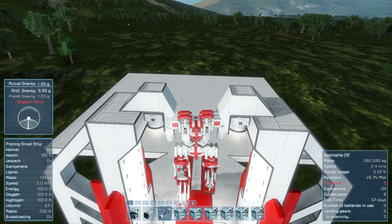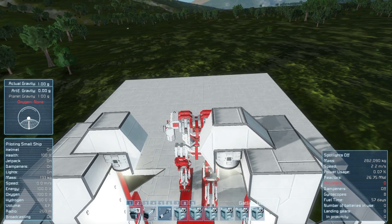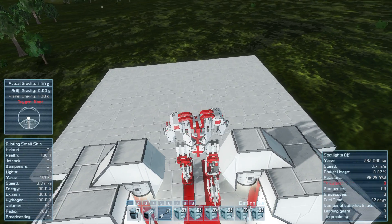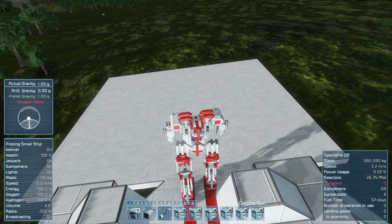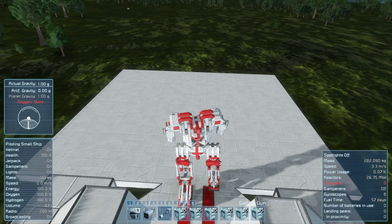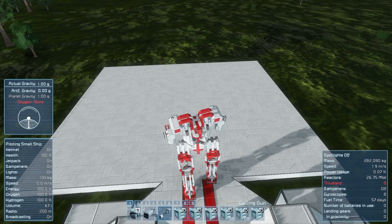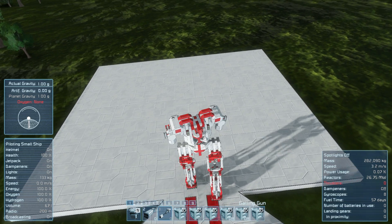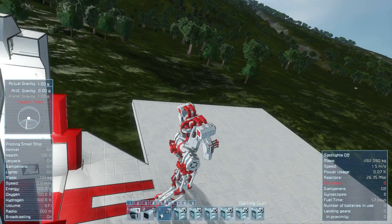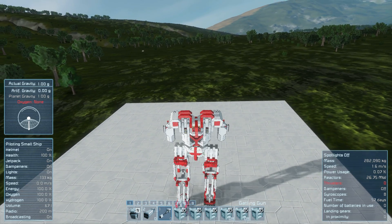A bit wobbly, but now instead of standing still, he's going to take a step with the left foot and continue to alternate back and forth between right and left until you hit six again. Let's let him take a few more steps and get out into the middle of the platform. Sometimes the feet don't lock down and you end up eating dirt — so it's not perfect, but I hope this build inspires other people to take on the challenge of making complicated mechanical walkers.